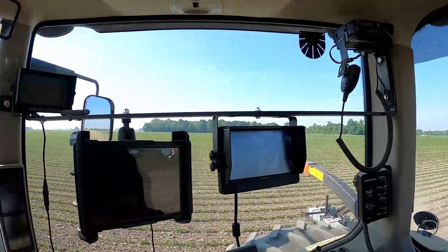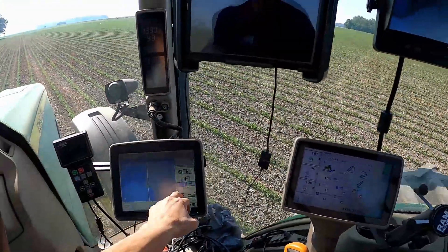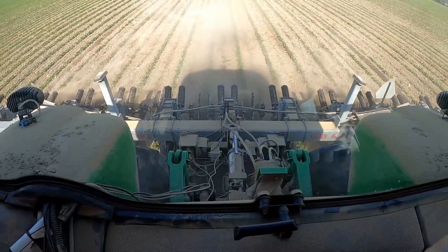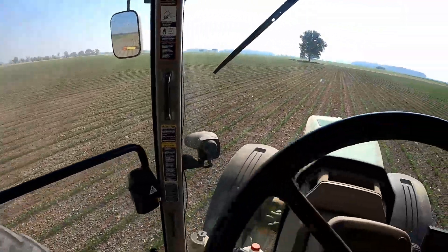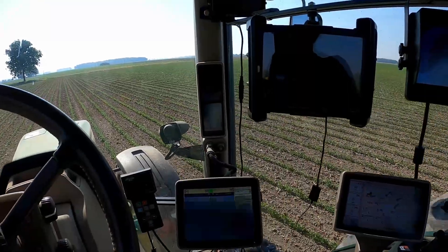I'm definitely going to be doing that in the future. I know I said on the last video that I wasn't sure if it was even worth being out here — well I can tell you right now that it was worth it. I'm running about five miles an hour, that's where I feel pretty comfortable. I can watch the camera and shift my line a little bit if I need to. I do have the AccuTrack hitch on the tractor and the sway blocks out, but I was having a little trouble with the sensing — it just wasn't staying on the row very well, so I decided to shut it off and rely on the RTK while watching the camera.